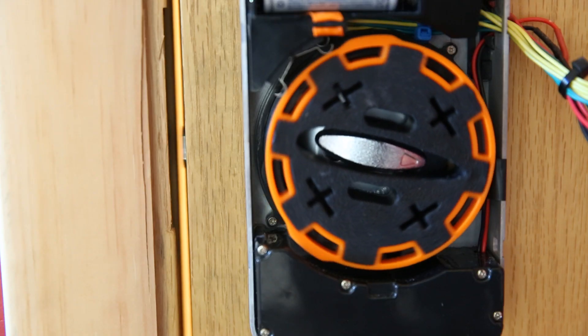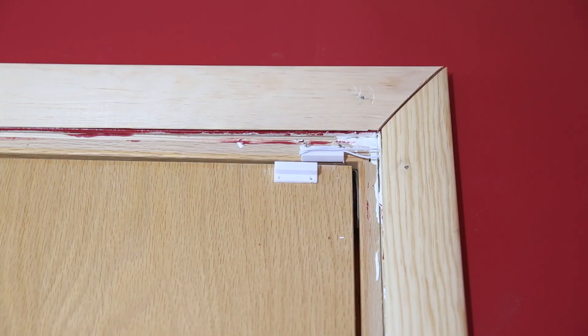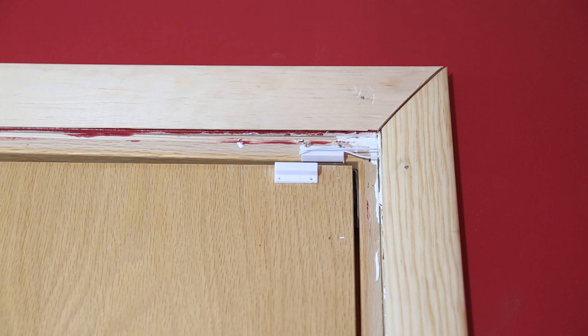The RFduino allows me to use Bluetooth Low Energy to send commands to the device and lock and unlock my door as I see fit. Now that we've unlocked the door, I want it to close behind me automatically so I don't have to pull out a key or some other device. We've hooked up a reed sensor to the door, which is connected to the Edison, and that'll tell me when the door closes behind me and will automatically lock it. Let's give it a shot.